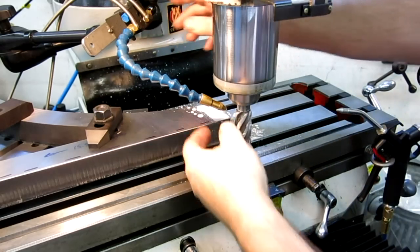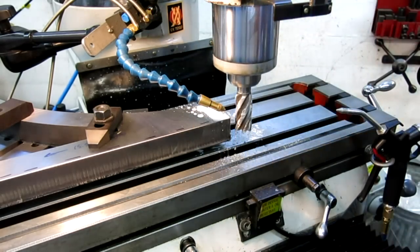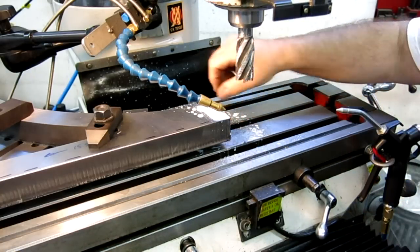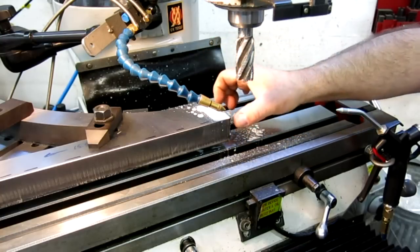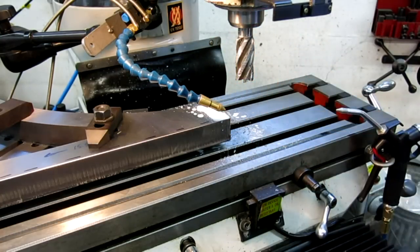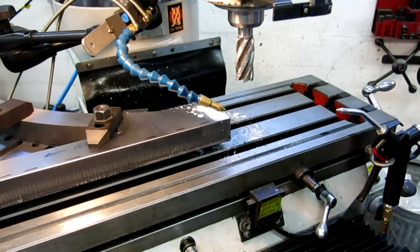So one kind of tricky thing when you have burnouts like this is getting a datum and getting started. So I clean this end off here, but there's no guarantee all the other ones are going to clean up at the same place, right? So it's always kind of a tricky thing. They're going to average out, but you got to be a little bit careful with that. All right.